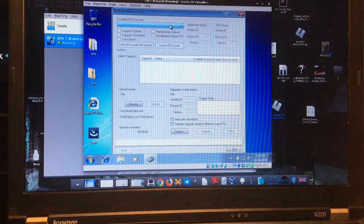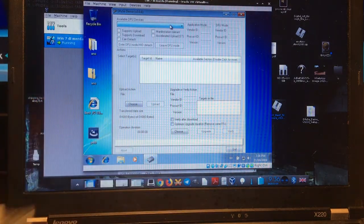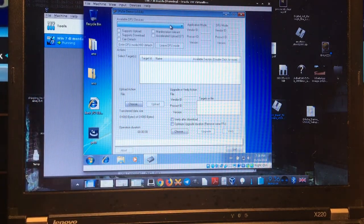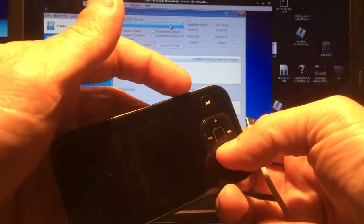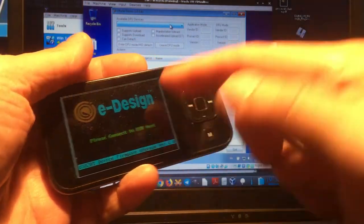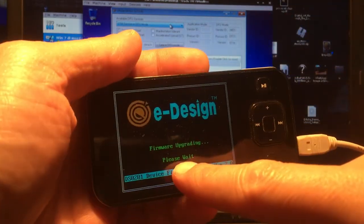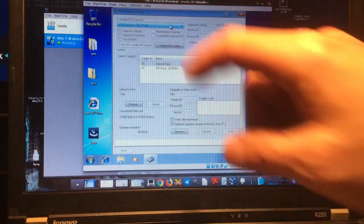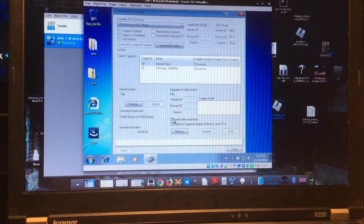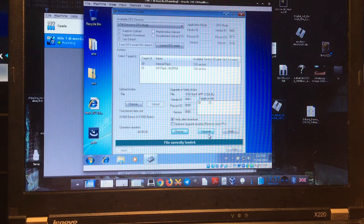You hook the oscilloscope to your computer with a USB cable. I plug the USB cable in, start the DS Nano with the down key held while turning on — the screen shows 'please connect USB to host.' I do that. The program shows 'STM device in DFU mode' — you choose Verify, then select the firmware app file, and click Upgrade.